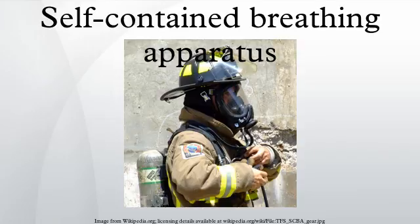However, some users refuse to use positive pressure technology because in the case of damage or loss of the face piece, the air will be released uncontrolled. The leakage rate can be so high that a fully charged SCBA will be drained in less than three minutes — a problem that does not happen with negative pressure SCBA systems.